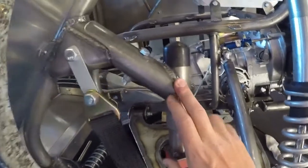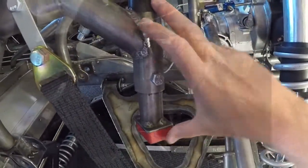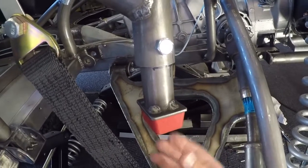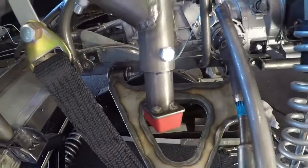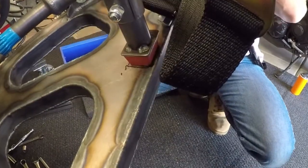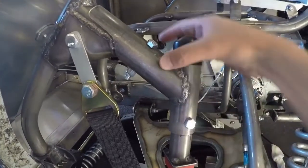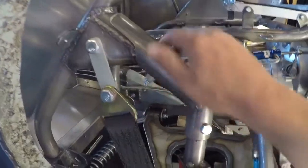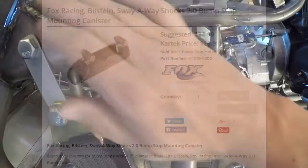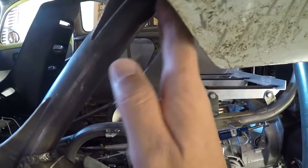On this bump stop, I was able to integrate it into the bump stop that I welded up for the swing arm. Before, this portion of the bump stop was just turned, and through here it's the same design — if I remove this bolt, the bump stop comes out and I can change how far in or out it goes for adjustability. But this design would not work long term because if I hit this bump stop really hard, all that force would have to be transferred through here, and there's a good chance it would bend here or even damage the chassis. So I'll purchase the adjustable clamps that come with pneumatic bump stops, fabricate a whole new assembly, weld that onto this portion of the chassis, with an extension that runs up and ties into the chassis up here.